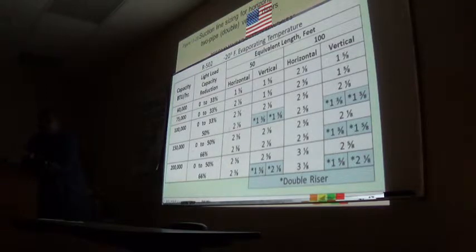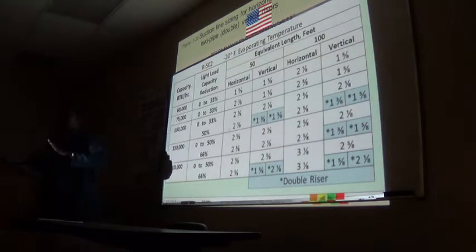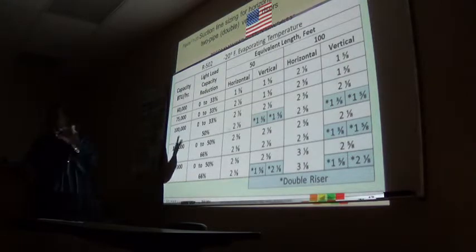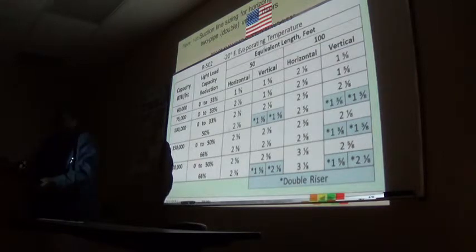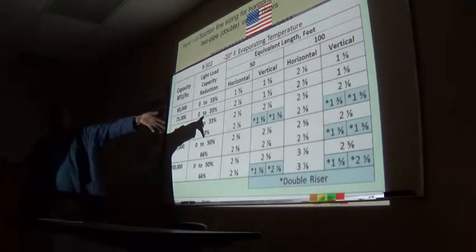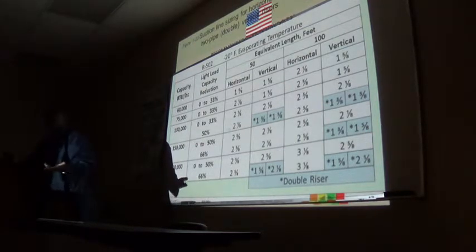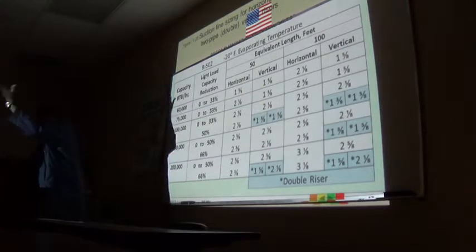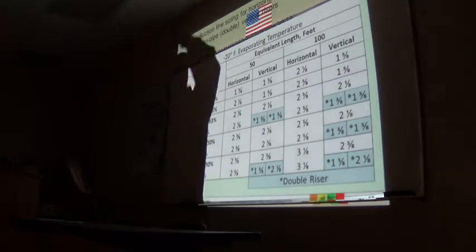All right, and here's the reason. If you have a box that's 8 by 8 by 8 and you only keep it at 25% full load, then your compressor, your condensing unit, will be short cycling, turning off and on, because by the time it starts up, it pulls down the temperature since there's no load. So that's going to short cycle. You're also going to get a moisture problem. If it's a box where you don't want very high humidity, you will end up with high humidity because you're dropping the temperature without removing any humidity. What you're going to have is sweat in the wall, sweat in the floor, sweat all over your product.